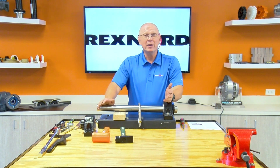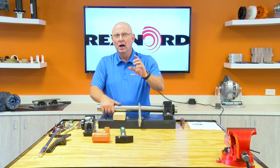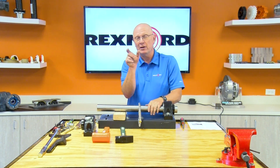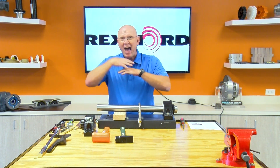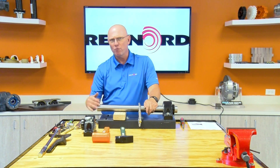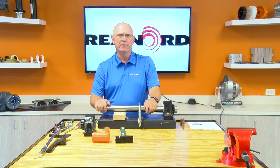Tapered adapter is by far the best way to lock to the shaft because it provides, first off, perfect concentricity — so very little runout, almost no runout, so little vibration. Vibration is a bearing's enemy, so we eliminate vibration. There's a tremendous amount of grip force because the tapered adapter sleeve contacts the shaft along a fairly long length, giving a lot of contact surface and tremendous grip force. Done correctly, these won't come loose compared to a set screw or an eccentric collar. Tapered adapter is by far the best way to go for reliable bearing performance.